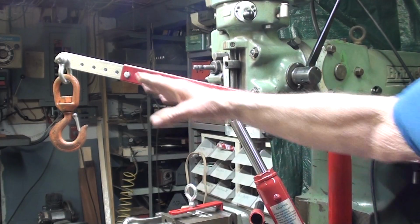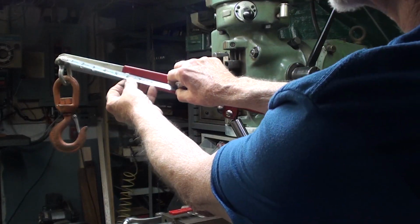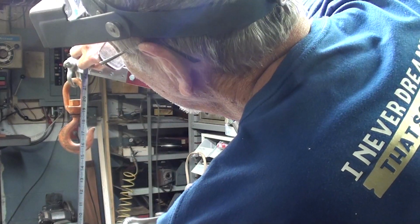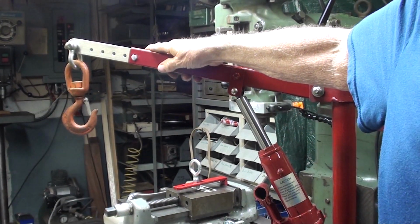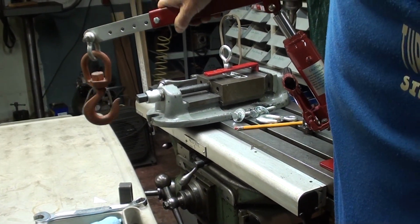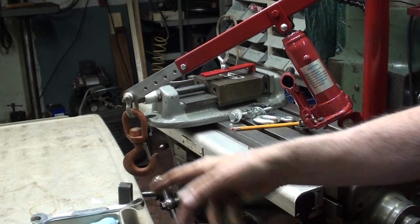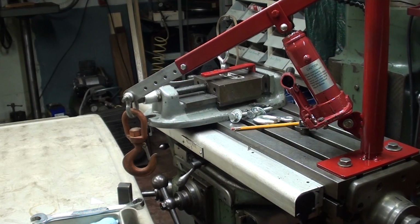I think you know that I had limited boom movement. Now I added the 5-inch extension on there. What was the original? I think 9 inches. But now I have about 16 inches of travel. If I can push that down, overcome the oil. There. That's as far down as it goes, but I measured from this and had that amount, 16 inches, so it greatly increased the travel.